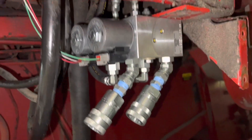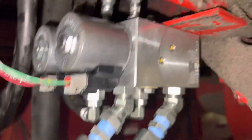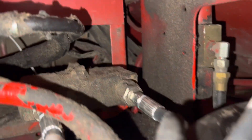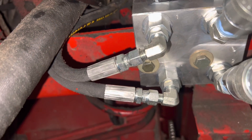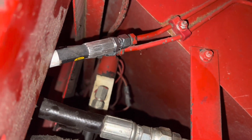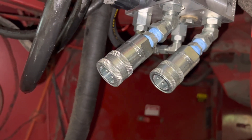Pretty happy with how it turned out. This is a Fosse selector valve — got it from Shoups. Up here you can see two new lines going to the original unloader auger valve for the swing, and there's tubing running up to the hydraulic cylinder. The incoming side comes in on the top of the valve. On position one, those two lines go to the unloader auger. On position two, we've got a couple of quick connects that we'll plumb up with hoses to go to the header.